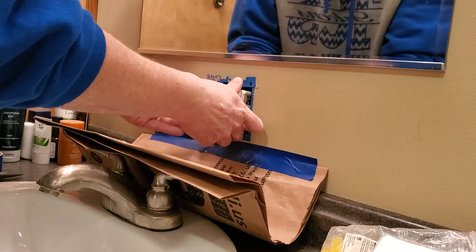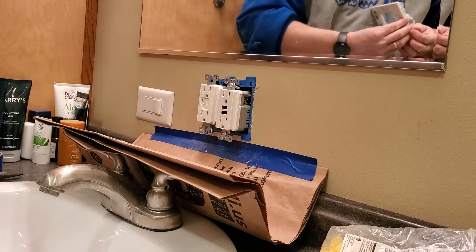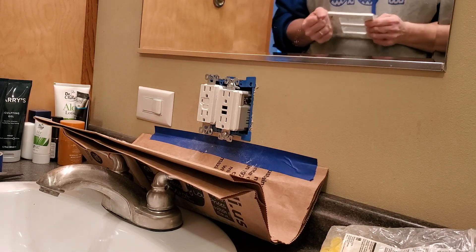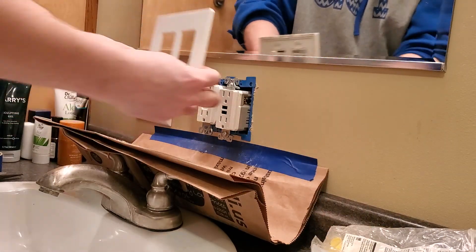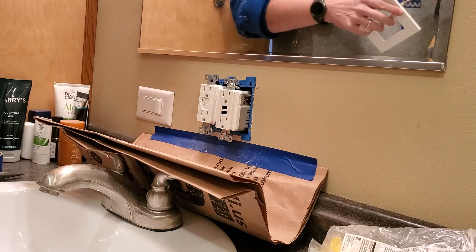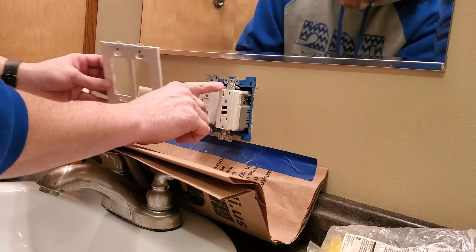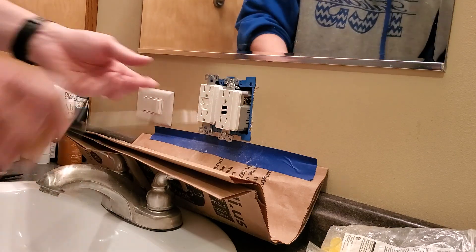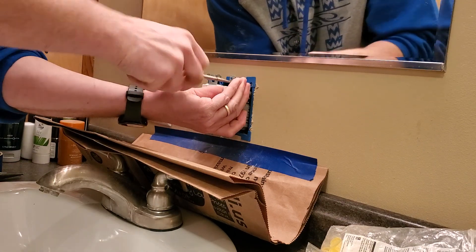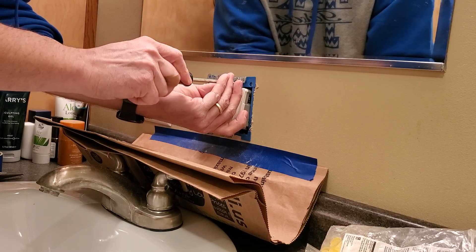I don't want that ground wire coming up near my hot wire — then we're arc welding, and we don't need that. I'm going to look at how my plate attaches because sometimes you need screws to attach the plate. This nice-looking cover kind of just snaps on. There's a little hole up on top of each one, so these still attach into your box. I'm going to attach those and get them snug so they're in place. Cody, I get those training boards from you and you always have everything snugged up good and tight.